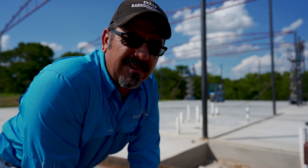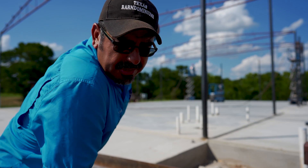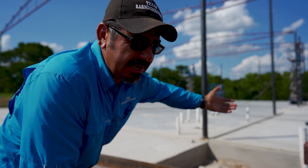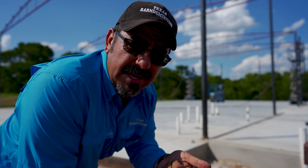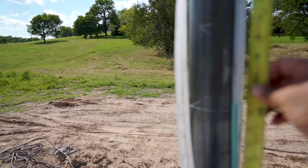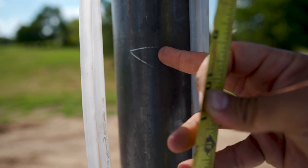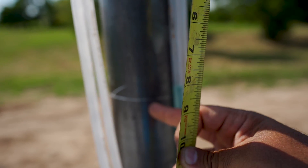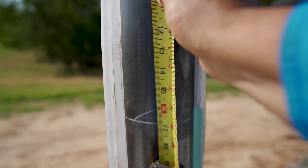I got all the pipes marked — well, six pipes. I didn't go over where those guys are welding under that truss because that's not safe, so I stayed away from them. Six pipes is plenty. Let me grab a tape measure and measure the difference between the marks. This is the line made with the laser and this is the line made with the water level down here. I'm going to measure between the lines, holding the tape at 10 inches up here.